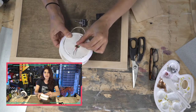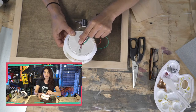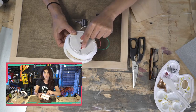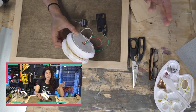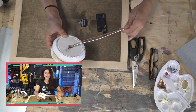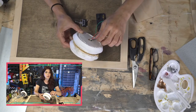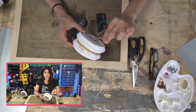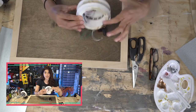And then you'll see an extra ground and power, because what I want to do is supply another power source to the tail end of the LED strip. And of course we have ours from the head end. That way we're pretty much sure not to get any voltage drop. We don't have a huge long strip. We're powering about 109 LEDs, excluding these.